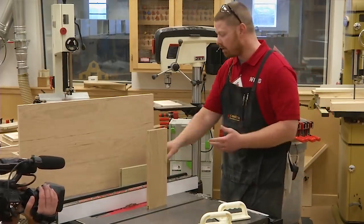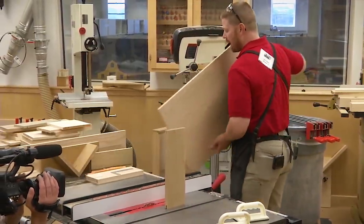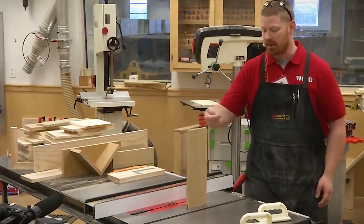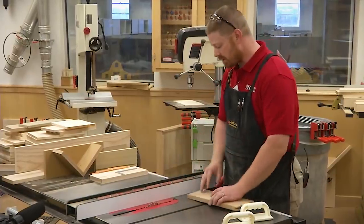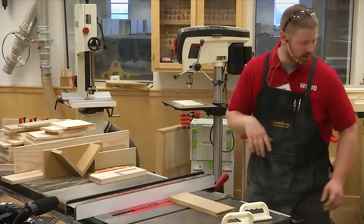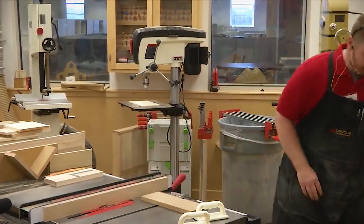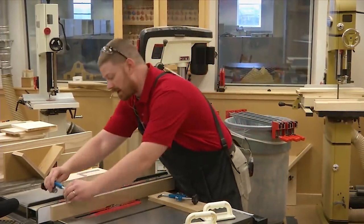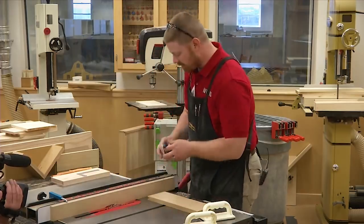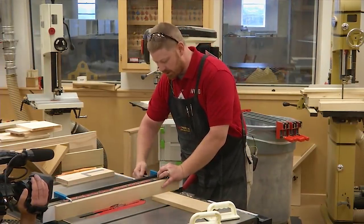And now to do this, I could take out my dado set, put in a regular saw blade, and just make that cut. But what realistically is going to happen is all you're going to do is create a little projectile that comes shooting out at you anyway. So I'm not going to change my setup. I'm just going to put my sacrificial fence back in and then machine off the whole thing. Basically turn that off cut into sawdust and not have to deal with little projectiles.